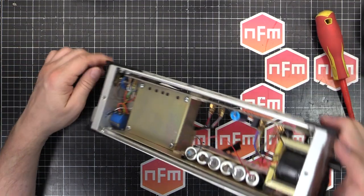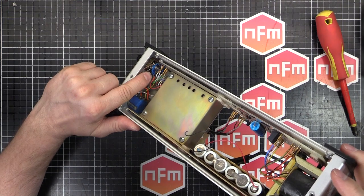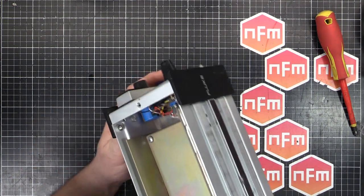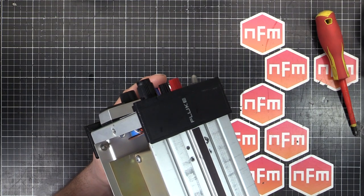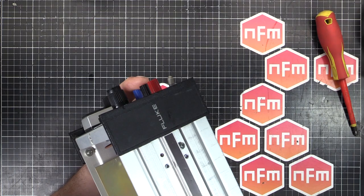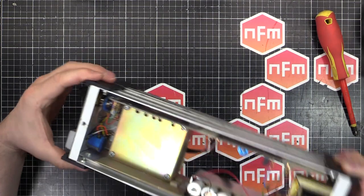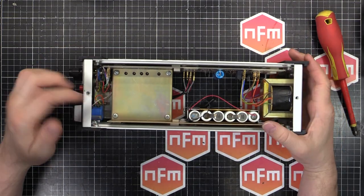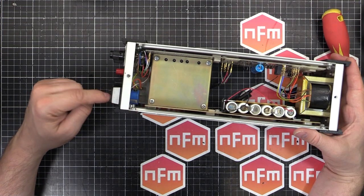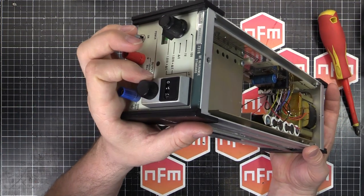And then at the front, we've got a nice little rotary switch there, and a multi-turn pot. I'm not sure, but it's probably a 10-turn, I would say. 5K linear. And it's a Bourns, so it's a good quality one there. You want a good quality one for that. And it gets a lot more turns through a little gearbox inside this case here.